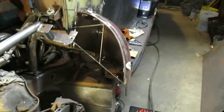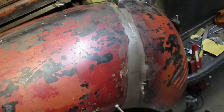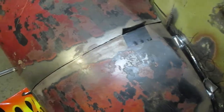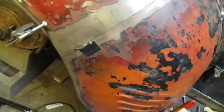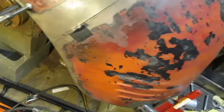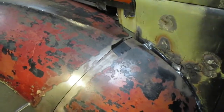I put the hood down to see how it all lines up. The fender is lining up pretty good — a little off here and there, but keep in mind that's only a bare wheel cut. It's going to be at least three-sixteenths to a quarter-inch thick, and down at the bottom I'm going to run that edge off on both sides so it has a little clearance. I think it's pretty good, and I'm going to leave the video there. Have a good one.